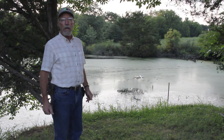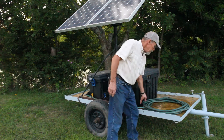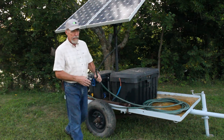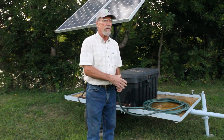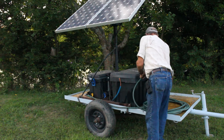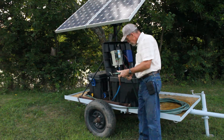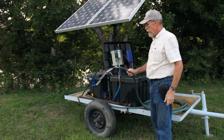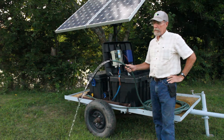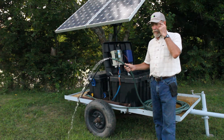Maybe we should take a look and see if it will pump some water. We don't currently have it hooked up to a tank for demonstration purposes, but you would have this hose running off of the pressure tank and run that to a regular tank float in a stock water tank, or to a sprinkler system. I'll go ahead and turn it on. There's no noise because the pump is out in the pond — it's making a little humming noise underwater. It just has a little air in the line because it's been turned off. But there is the water from the pond.